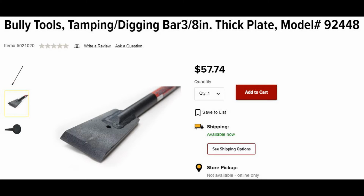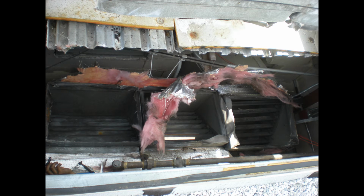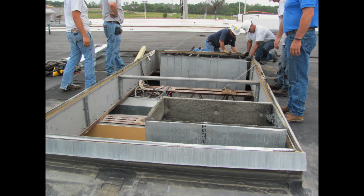It's actually got a chiseled end on it. It's got some heft to it. It would be a good tool to actually get in there. You can shear away the ductwork, shear away the heads on the screws maybe, and get that ductwork popped loose and popped away from the zone unit and disconnected from the unit. That way you can lift it away without tearing up the zone head. So you're finally able to get this cut loose and pulled away.